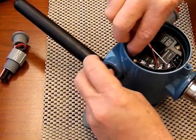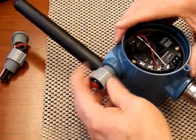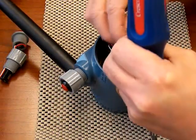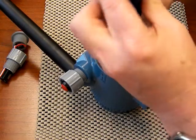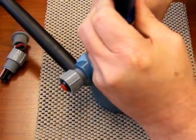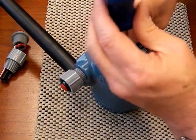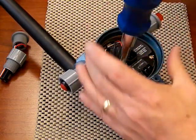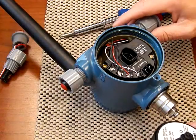Then to install it, you can reinstall it again just the opposite way. They are not polarity sensitive. The switch assemblies in the original design are to be installed on the 648 wireless temperature transmitter, though I don't believe they were on many of them because of the way the switch works — it's not really a requirement. The purpose of the switch was to demonstrate a shorted output on the RTD.